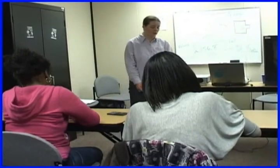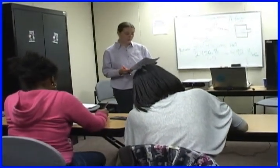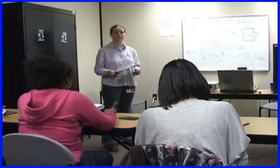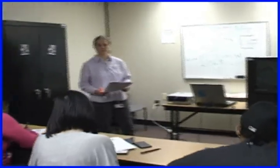All right, windows. Is there significant air leakage by the windows? Yes. Any comments? Why were there significant air leaks? I don't think they were that bad, though. When I checked the kitchen windows, there was a lot of air leakage coming in. What type of windows were they? Sliding windows. Air was coming in from where they joined together.